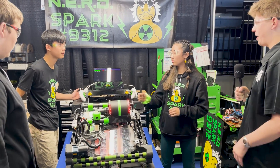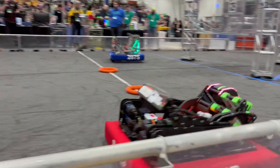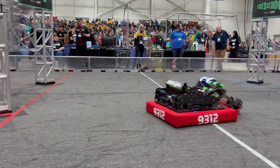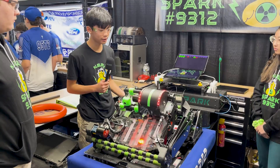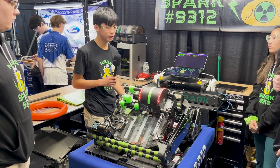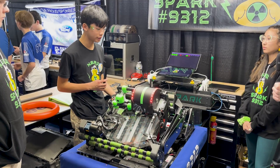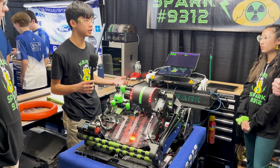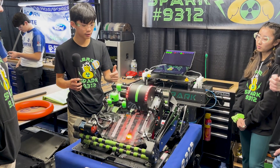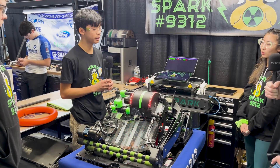Awesome. Maxwell, why don't you tell us a little bit more about the vision, AprilTags, and so much more here? So we have three cameras facing three different directions on the robot, and we're running full field localization on the AprilTags. Using that localization, we can figure out the distance to the speaker, and we have an interpolation map between the angle of our four-bar and our distance to the speaker. We also calculate the angle to the speaker and automatically rotate the robot to face the speaker with just one button.